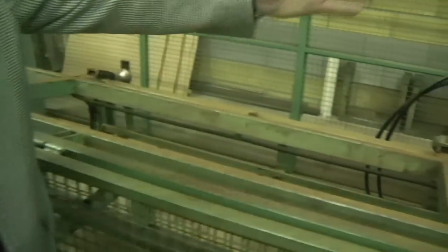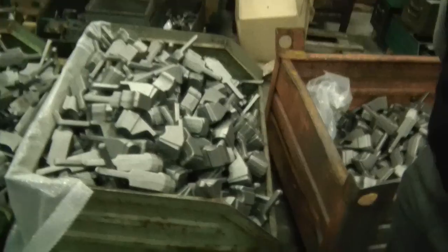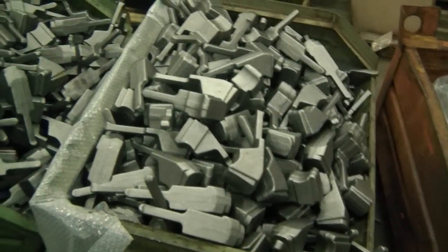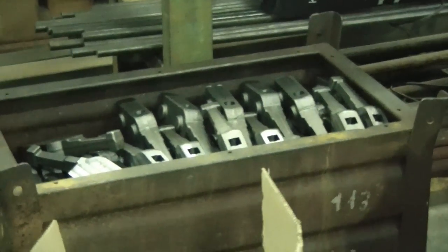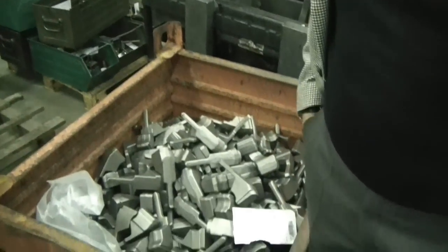This material is on here and it's cut in. All forged frames for the Sharps — it's important we use only forged frames for the new 1886-71 lever action model. We use forged frames for the rolling blocks as well. The forged is of course a guarantee of quality of the piece itself. Why is a forged frame better than cast steel? Because of the compression of the material.